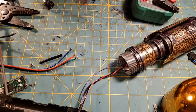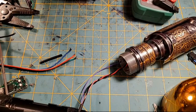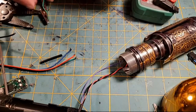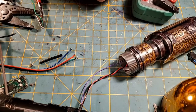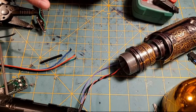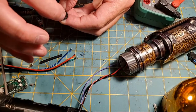I don't know that it's working still. Let's see. Still not. I still don't have tone on that power switch. So I am not comfortable finishing this install because we don't have tone on this power switch. I really think I need to take this switch apart, clean up those pads, and fix this switch. I have no tone on the power switch.